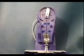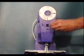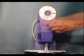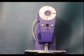Insert the upper end of the clear tube into the hole in the finger guard. Replace the cover and the 2 screws that hold it on, and we're done upstairs. Now we're ready for the most important step, and that's to add water to the bottom of the saw.